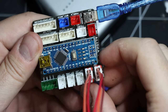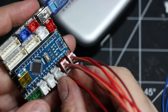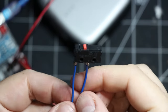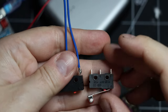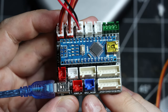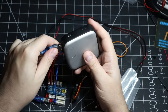After soldering one of the provided plugs into the LED eyes, attach them to the dedicated spot on the Alicia board. The board has two dedicated eye spots — since I soldered both eyes into one plug, I used the other to power additional LEDs covering small holes on the back of the helmet. I then soldered another provided plug to the limit switch button. Clip off one prong and remove the rolling lever, plug it into the Alicia board, and you now have the minimum working circuit.